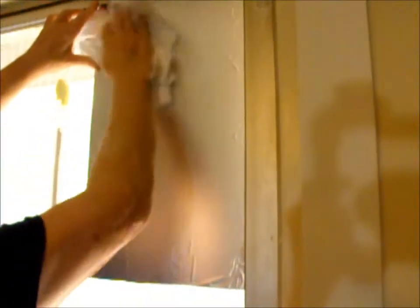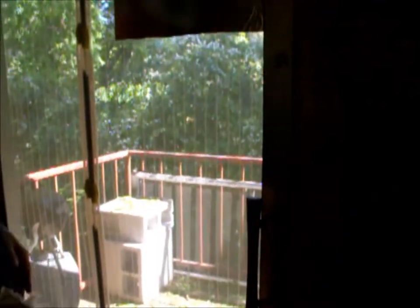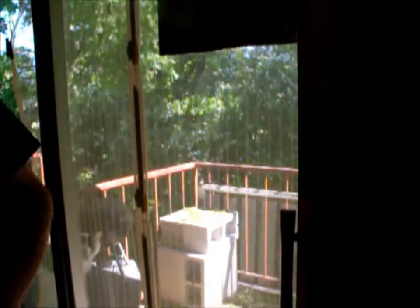Now, when you get done putting that up there, go ahead and smooth it out with your hands as best you can. Take a paper towel, go over it, smooth it out, and dry your window so that you don't have streaks all over it. Keep it clean. And now if you need to overlap, okay, which in many cases you will, and I recommend you work with shorter pieces and overlap, simply because shorter pieces are easier to work with.